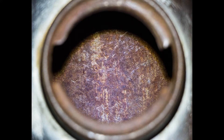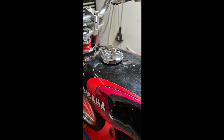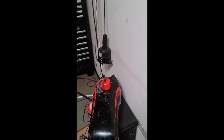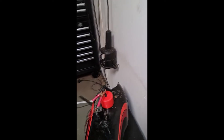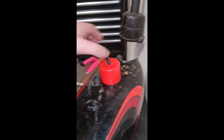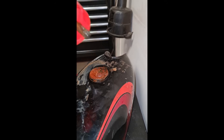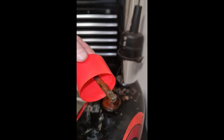We decided to use a process called electrolysis, which is basically just passing 12 volts of electricity through the tank but through water. So you earth out the tank, you put the negative terminal of the battery charger onto just a part of the tank — we use the tap — and then the positive terminal goes onto an allen key which is dropped inside the tank but not touching the tank, it's just inside the water.